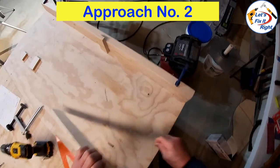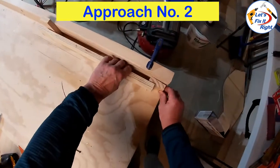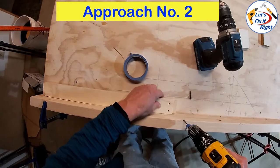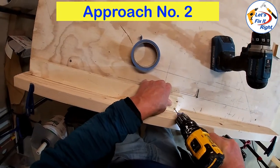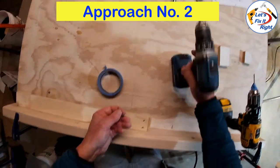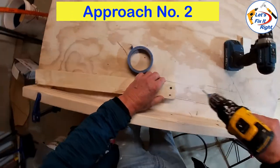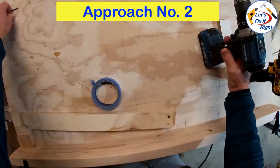Like we did before, you'll want to align the bottom of the piece of interest to the bottom of the plywood anchor board, because both of them are going to rest against the compound miter saw fence. Next, we'll run a small pilot drill part way through the pine so it won't split. We'll then put the first screw in to hold it into position for drilling a second pilot hole, then drill our second pilot hole and add our second screw.